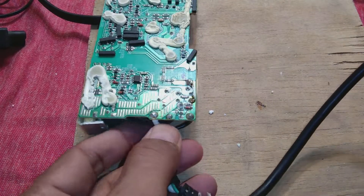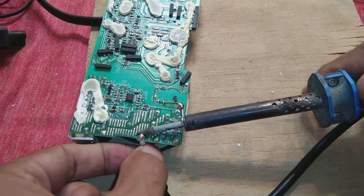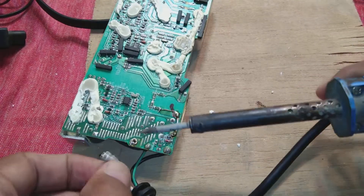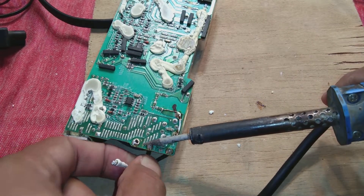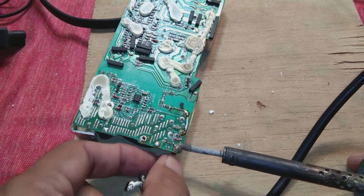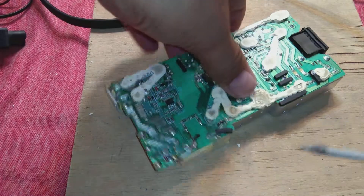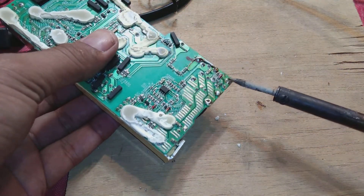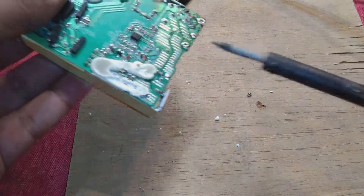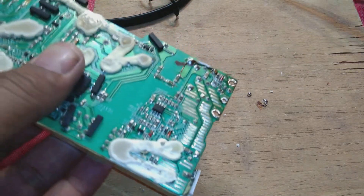What we can do is repair this by removing the connections using the soldering iron, then put new wire ends on the board. I'll cut some wire and show you how I'm doing this. Care is a must - don't put your soldering iron here and there on the circuit board because surface mount components are there and you can damage them. Put the wires back in the same position where they were. I'm just cleaning these holes for the new connections.